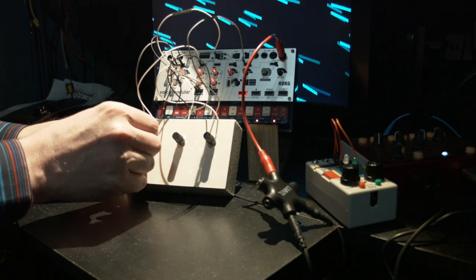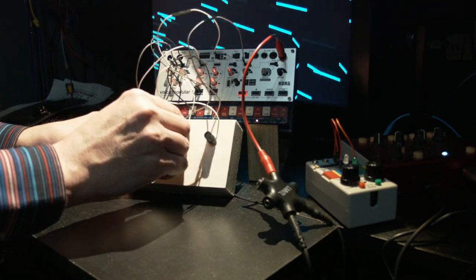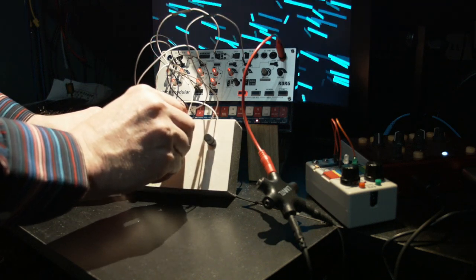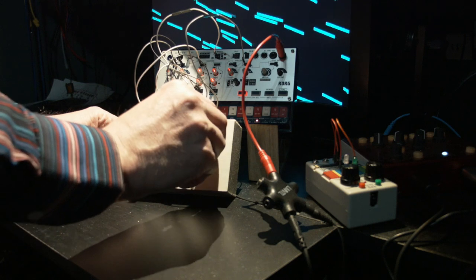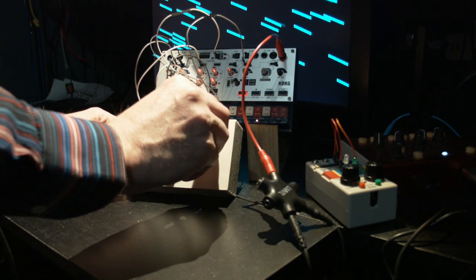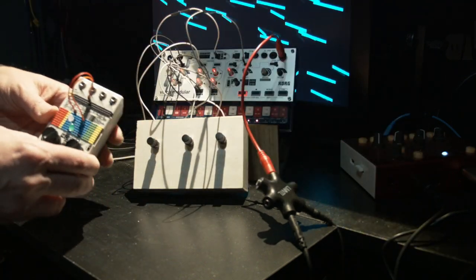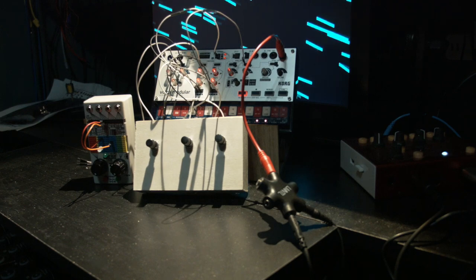What could be cool is if you had a nice setup — some stands from Reverb that allow you to mount multiple Volcas. Imagine two or three Volca Modulars and other DuPont gear together. However, I noted a few people on YouTube warning that there could be an issue harming a device if it's not grounded against the other device, so I wouldn't recommend patching between different DuPont devices yet. Within one device it's pretty safe. You could also create an interesting array similar to the Folktek Resist module — the Resist runs about $40–50, but this DIY version is much cheaper. It's a really fun opportunity to think about doing something different — hacking your Korg Volca Modular.